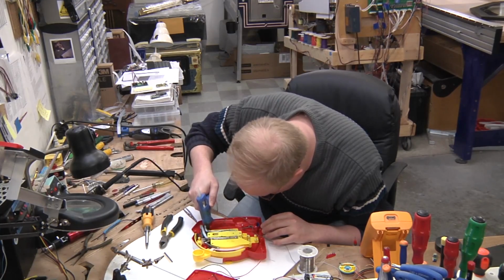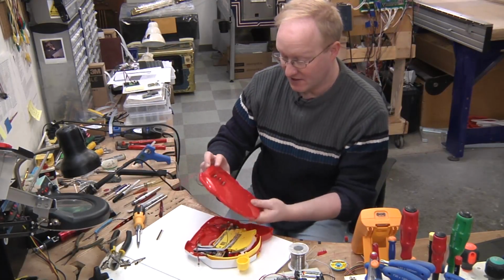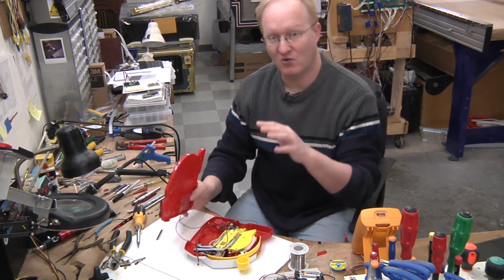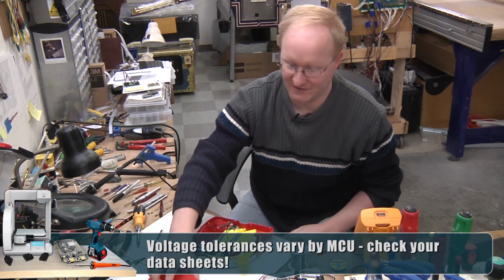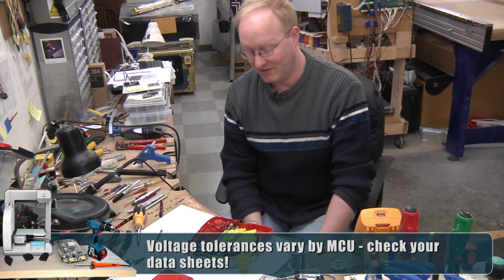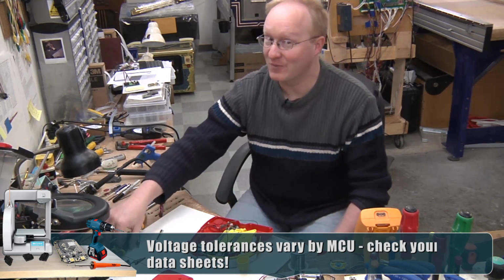Liu Kang wins. We'll probably want to create a power switch for this as well, but we should be able to use the original 3 batteries, although we'll need to step it down to 3.3 volts. The propeller is not very tolerant of higher voltages. And even if it were, we should still give it the right voltage, 3.3 volts, not 4.5.